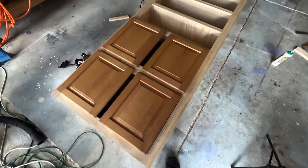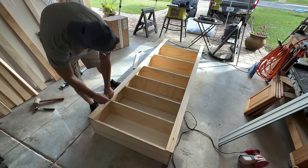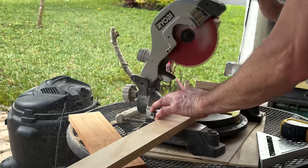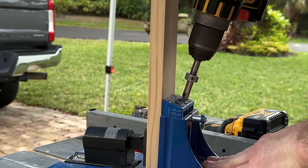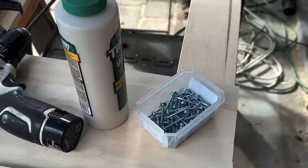These were some doors that we pulled out of a remodel that we did. I'm a fairly novice woodworker and this was the first time I've ever pre-built a face frame, and to be honest it's probably the only way I'll do it from now on. It really upped the look of the final product - it looks super crispy clean. I used pocket holes with wood glue and a clamp.